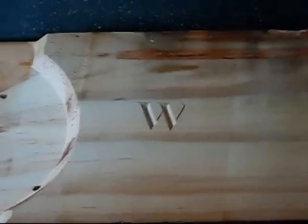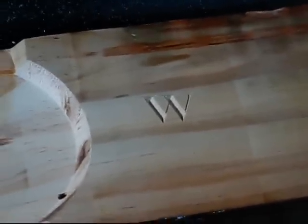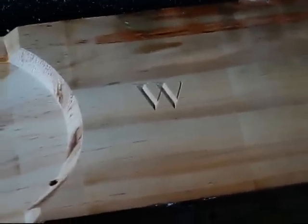That's a little better — you can see it's nice and crisp. I set the tolerance to one thou. I could have gone higher — in fact I did go higher — but I had to lower it because I'm just using the demo version of Mach 3, and when I set the tolerance too high, the file becomes too big for the demo program to run.